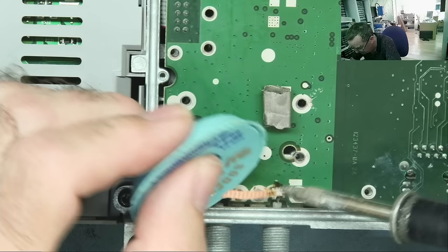So here's our power supply. First thing then, is there any high voltage in it? You would think because it's running, there probably isn't, but probably and definitely is not the same thing. This, I can see this is the power coming in. This will be a filter. Yeah, look, this must be four diodes. So this will be the plus and minus out of the bridge rectifier.